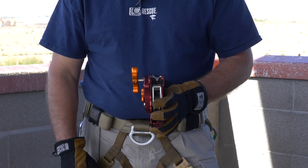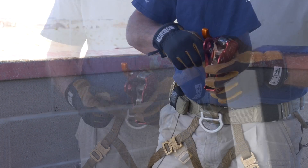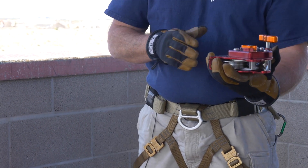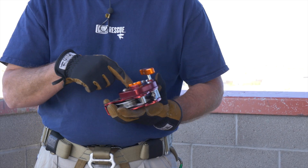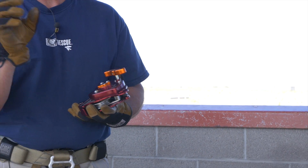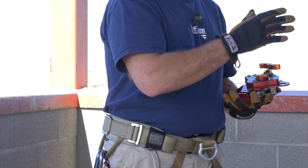I can force rope in with a heavy enough load and enough mechanical advantage, but you're going to know right away if the parking brake is on because when you lift up and try to turn the handle, there is a lot of resistance and it shouldn't be that way. If you grab ahold of it and turn it and look at it from the bottom end of the device and turn the parking brake on, you see how much that swing brake actually moves into that maximum friction position. Also keep in mind: if you try and load rope into it with the parking brake on, it isn't going to happen because there's not enough clearance between the swing brake and the fixed friction post to get the rope in. The parking brake has got to be off when you load rope into the device.